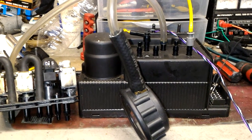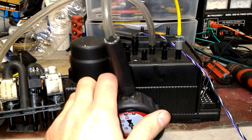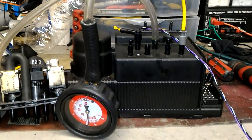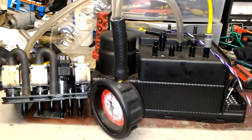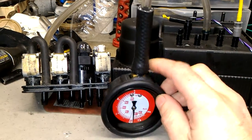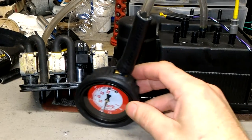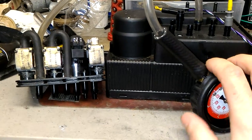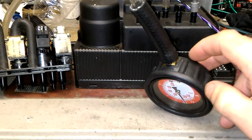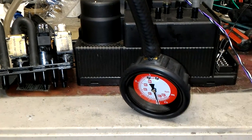What was happening is every time you would lock and unlock the vehicle, everything would work okay — door locks, trunk lid and everything would lock and unlock. But once the trunk is opened and closed, just as simple as that, then the door locks would stop working. And every time you lock and unlock the car, instead of door locks going up and down, the trunk handle would come out and retract, which is obviously not correct.